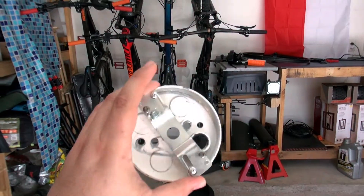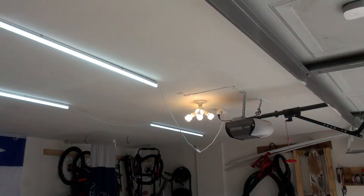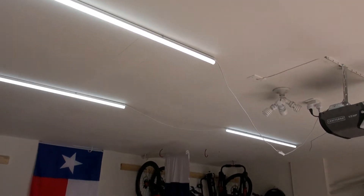I already started cutting - I'm gonna put a little piece of wood beam across there because my beams run like this. I'm gonna put a beam right there and a little receptacle to hold the light. I'm gonna attach it right there, making the hole a little bigger than I need so I have enough access to work. The first thing you gotta do is cut the power - if the light is on it is live. You can also cut it with the circuit breaker. I know if I have the light off there's not gonna be any power, but I'm still gonna test it to make sure.